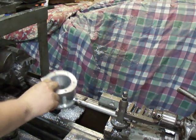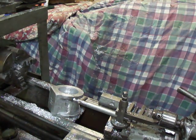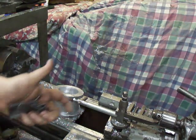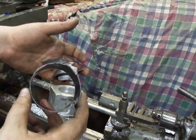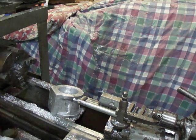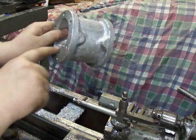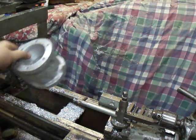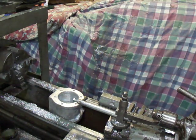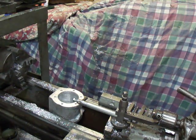I'll just bore it out to size and do it that way. I tried pushing the liner in — heated it up, tried pushing the liner in while it was nice and cold — and suddenly boom, it exploded on me. This part got stuck in the cylinder and I ended up having to take the Dremel and grind out a bit, so there's about a sixteenth of an inch dimple in there that I've got to machine out. It's still really hot. I tried pounding it out, tried everything to get this stupid thing out. Finally I just had to cut it out. So much for the cast iron liner — that sucks. I'll just bore it to size and get it done up that way.